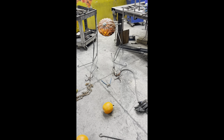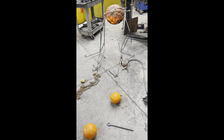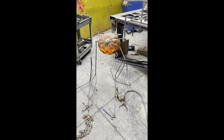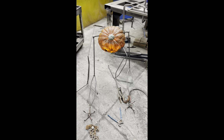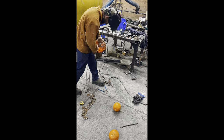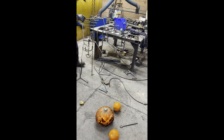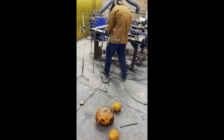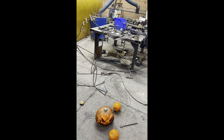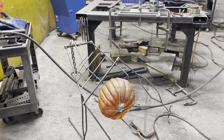It literally just collapsed right after I shut it off — I wish I got that on film. Having it semi-mobile is not good. The weld snapped — that's because I only tacked it. All the way along I've been tack welding everything until I had it in the finished position. This was an area of oversight — I forgot to go back and finish weld it. This is the second time it's broken. I'm going to walk away for a few minutes.